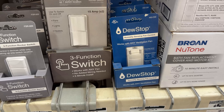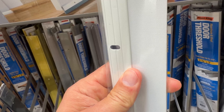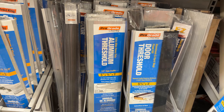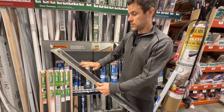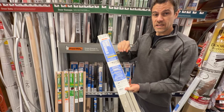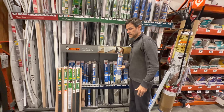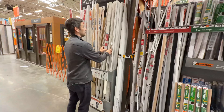They get pretty serious about weather stripping and weather seals for doors, starting from basic things. You need a good surface to press against, so one common product is door thresholds — a metal plate cut to size for your door with a rubber insert that pushes up to meet the bottom of the door from below. This goes on the bottom of your doorframe and accepts the seal.